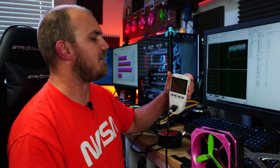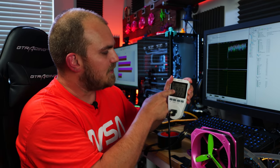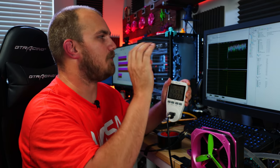Even the funniest thing about it: I turned this back on — the 7700K back up and running on the AIDA64 stress test at 4.9 GHz. It's currently pulling 165 watts while running this overclocked chip on AIDA64. And remember — just the fan alone on its own power supply was 280 watts. So that's insane.